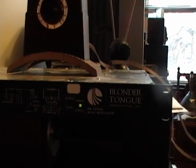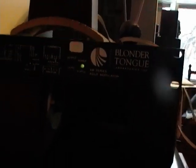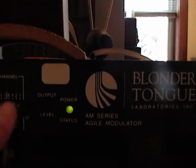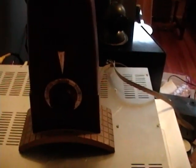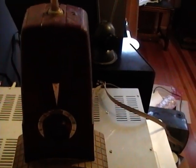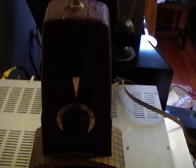I've got the Sentinel all back together. I hooked up the internal antenna on top of the cabinet and I'm going to use my Blonder Tongue agile modulator set on channel 9 — it's got binary switches here for 1, 2, 4, and 8, so I've got 8 and 1 turned on, which gives channel 9. I've got that hooked up to a Snyder antenna which has a rotary control that tunes the antenna to the station you select, with antenna elements, capacitors, and so on switching in and out.